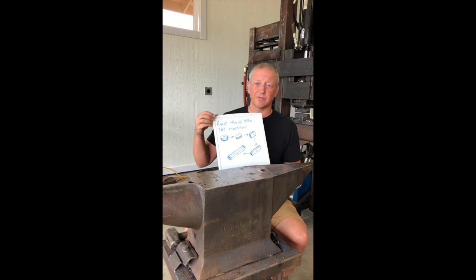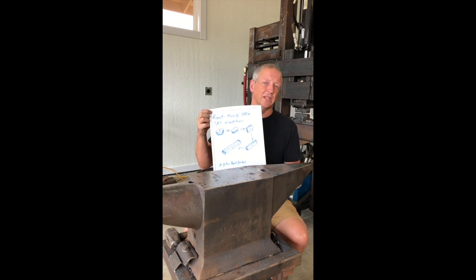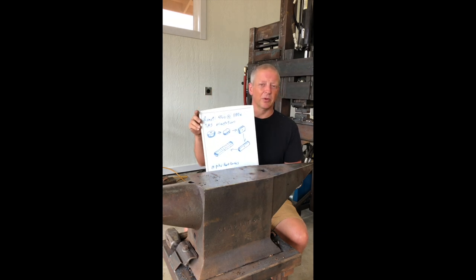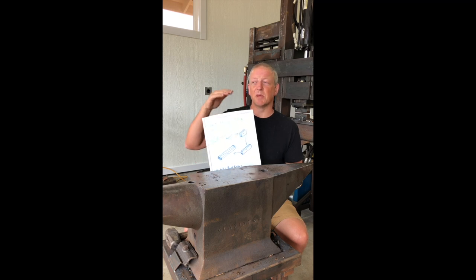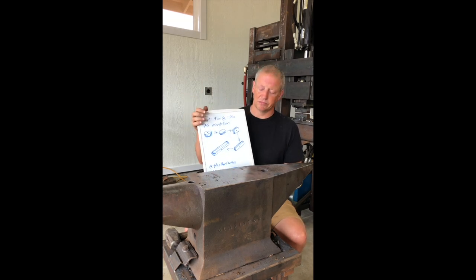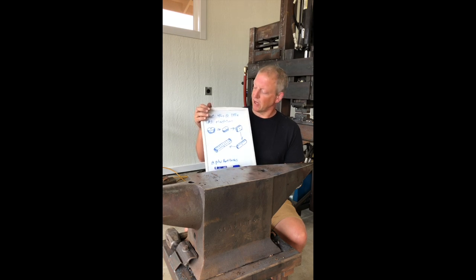So first of all, I have at this point roasted the ingot. I roasted at 1100 degrees Celsius for 4 hours, and that works out, I think, to like 2025 Fahrenheit. And I am going directly from the roast to forging. Some people like to let the ingot slow cool after roasting. I go straight from roasting to forging. Different people, different stuff.